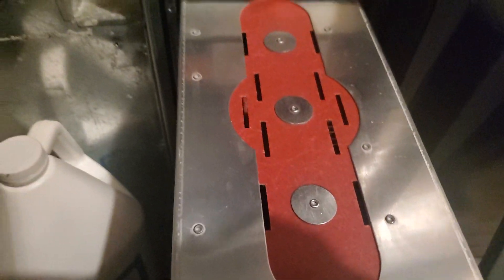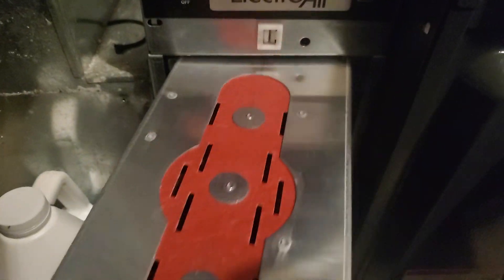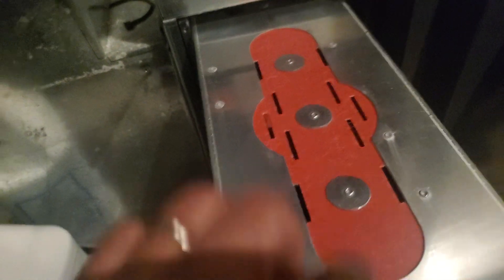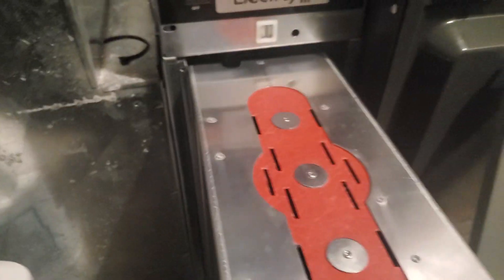Before I leave — on the other piece, these two or three contacts, there is a copper connection right here. See those? These are copper connections that contact these points here. What I like to do is take a very light piece of steel wool, or just something with a little abrasion, and lightly rub these off as well — just to make sure there's no residue from washing left on there. Rub those off and then slide it back in.